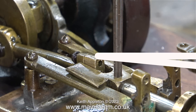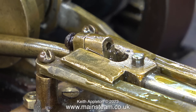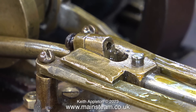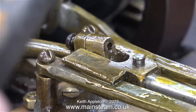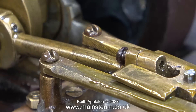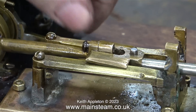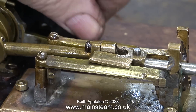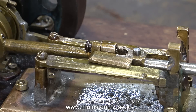That's it for the depression interlude. Now I'm showing the taper pin that I've tapped into the hole. This is not going to be the final one because I need to make some slight adjustments to level up the crosshead. This is an age-related, quality-of-manufacture, sympathetic restoration, so I don't want to do anything extreme at the crosshead. I will be adjusting the bearings - I can't leave them like this. Here I'm gently tapping the taper pin into position with a very small hammer. And the piston still goes back and forth. Look at the clearance between the crosshead and the crosshead guide.